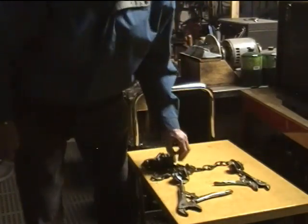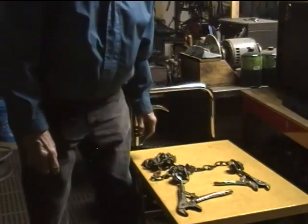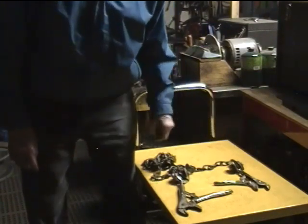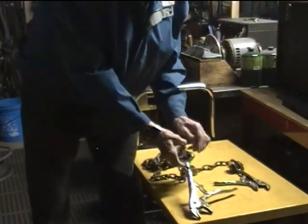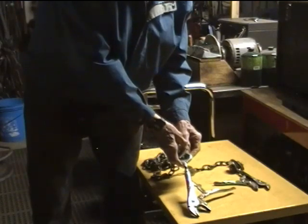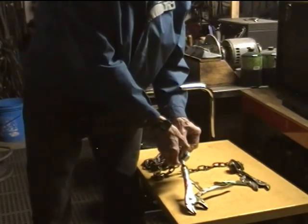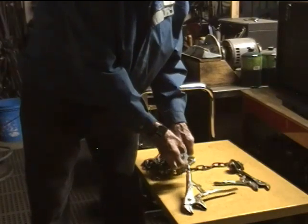When choosing the right kind of vice grips, my suggestion — I live in the USA — is to use original vice grips made in the USA with inch threads rather than metric threads. That's important because when I found out about this business of using the eye bolt instead of the adjusting bolt, they said just go to the hardware store and get the eye bolt. Well, in America you don't find any eye bolts in a hardware store that are metric — what they have is inch thread sizes. So you have to be careful of that.